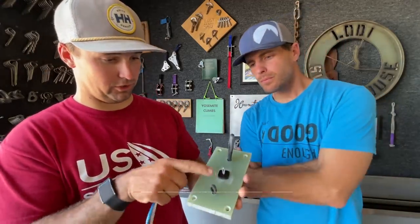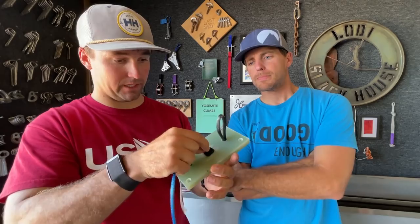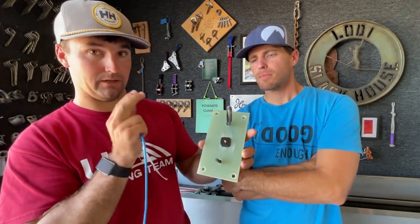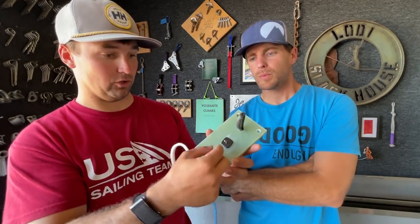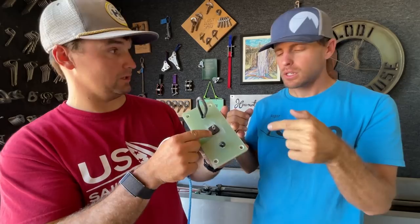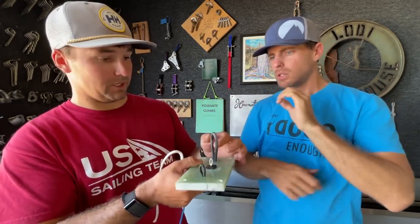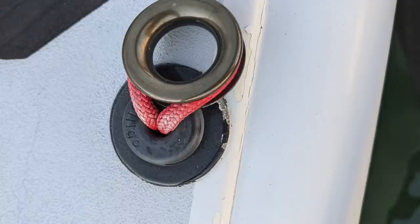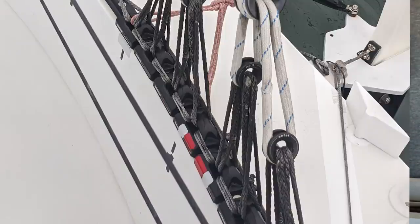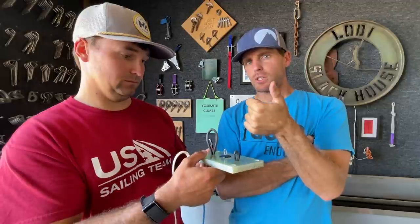So these are three different loops — one, two, and three. These two that go through — this is essentially the deck of a boat — are higher load. And then this little guy is sort of just an attachment, so you can glue it onto the side of a composite structure, fiberglass or carbon fiber, without having to drill a hole. Sometimes a friction loop or a ferrule will go in here and then another rope can run through the metal to reduce friction and chafe. Or you could attach a block to it like a pulley and have a separate rope run through the pulley. Chafing is rope-on-rope abrasion — what we call in climbing 'nylon saws.' And a block is what sailors call pulleys.